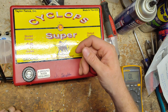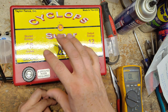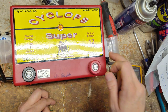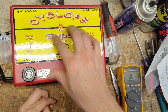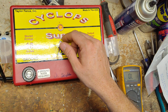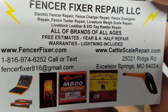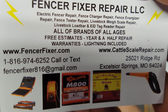If you go out there, do all your checks, the fuse is good, the unit clicks but the light won't flash, then you know for certain there are issues inside. At that point it would be best to ship it into a repair place like us. We are a repair place — we work on these electric fence chargers of all brands and ages. There are links down in the description below that you can click to go to our website.